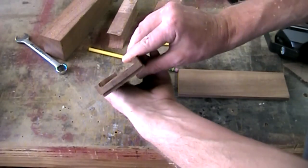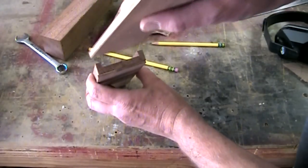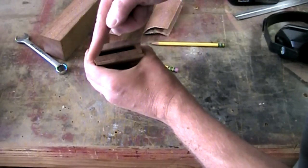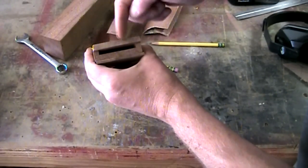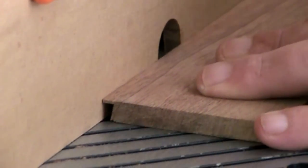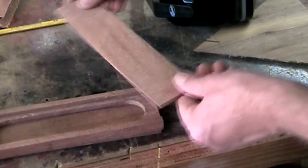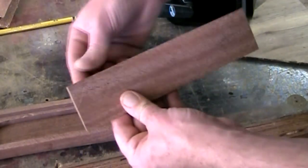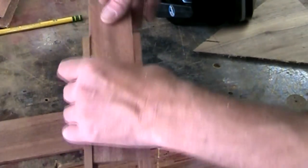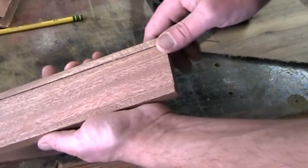This is how it's going to go. There are my dovetail cuts on both sides and the lid will slide into there right like that. What I've got to do is make this reverse dovetail cut on the lid. When I ran that through the router, I left a little bit of that lip up there so that it would run straight and not just fall back. Now I've broken all of that off and — not too bad like that. So that's how it's going to fit in. I can sand these parts down to get it even.